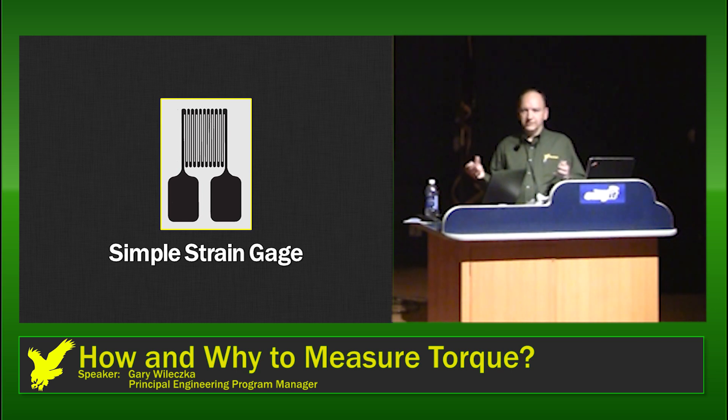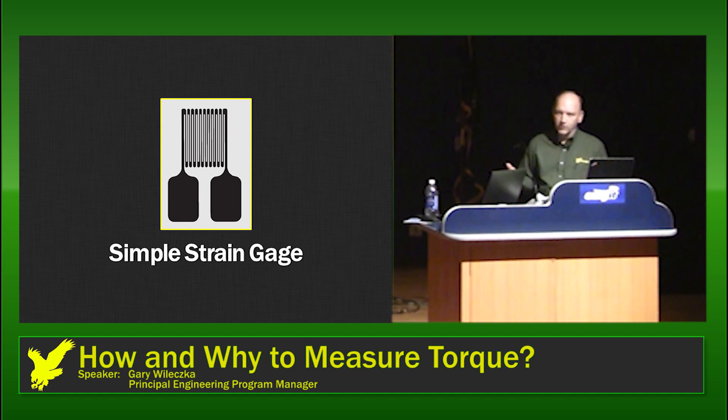The force required to stretch that material will vary depending on how thick and how wide the material is, so it's not really a force we're talking about — it's how much the material itself stretches. We actually make torque metering systems that go up to 1.2 million inch-pounds of torque, which is a hundred thousand foot-pounds. That's a lot of torque. Spinning at about 2,000 RPM, that's actually 38,000 horsepower — systems that can measure really large amounts of torque. 38,000 horsepower, 28 megawatts of energy.